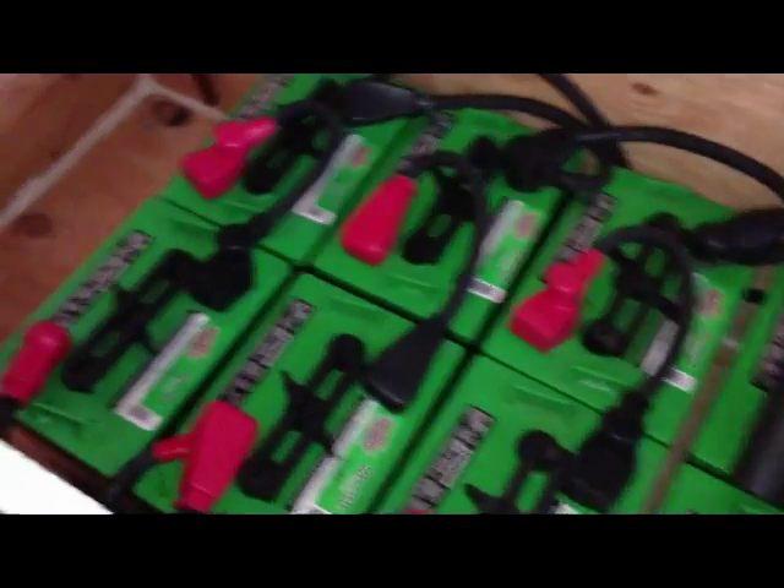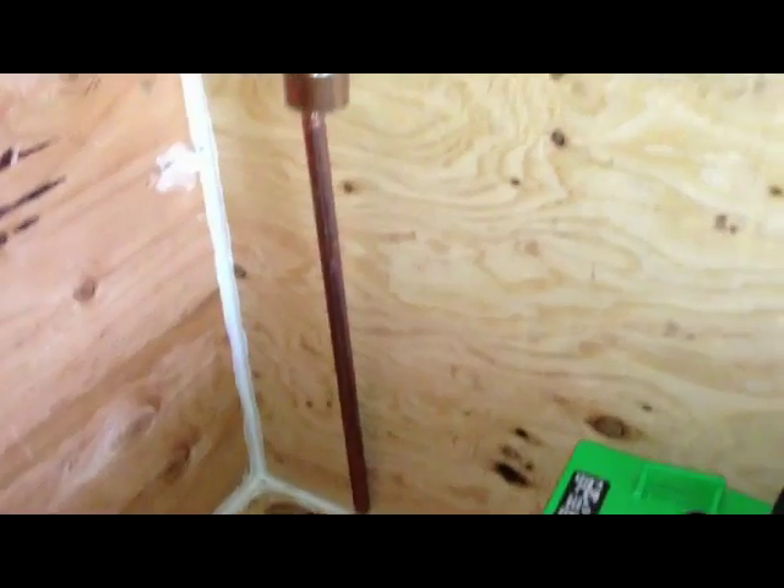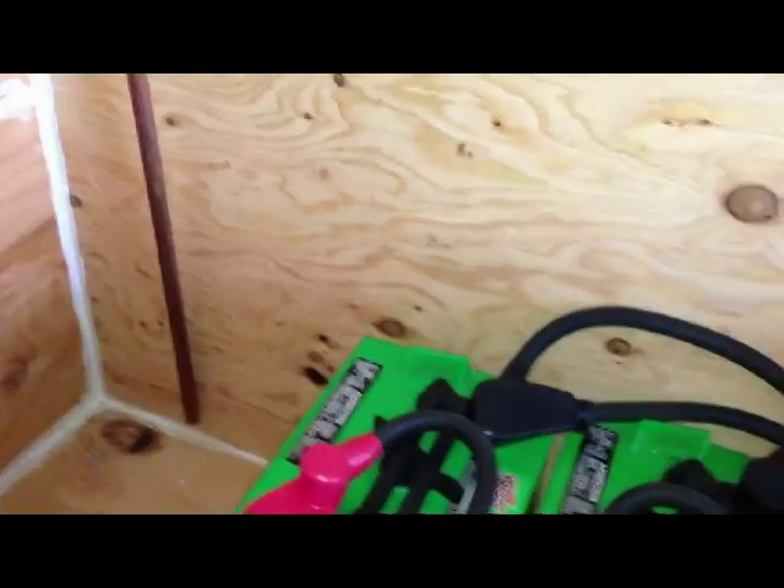As you've probably seen from my other videos, this is a passive venting method. These are lead acid batteries, of course, and all that hydrogen gas just accumulates. This box, by the way, is airtight — these have to be airtight. If you have any gaps, I used to go inside this box, close it up, make sure I could see no gaps. If I did, I caulked it or sealed it or even weatherstripped it, but I made sure there was zero gaps. That way the only place that hydrogen can leave — because it's going to rise — is going to be out there and then outside.